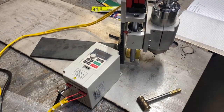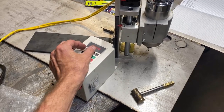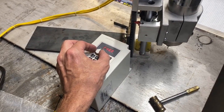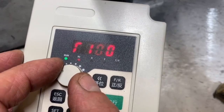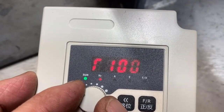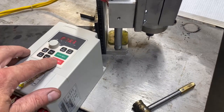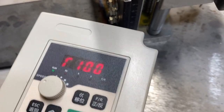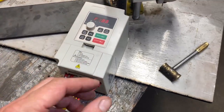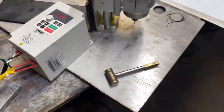Let me show you what this thing can do. At 100Hz right there, this thing is screaming. You can hit the stop button and it will shut off, then hit the run button and it will turn right back on. It has a slow ramp-up speed, as you've seen — that ramp-up speed can be altered. This thing's been configured and programmed; it can be changed.